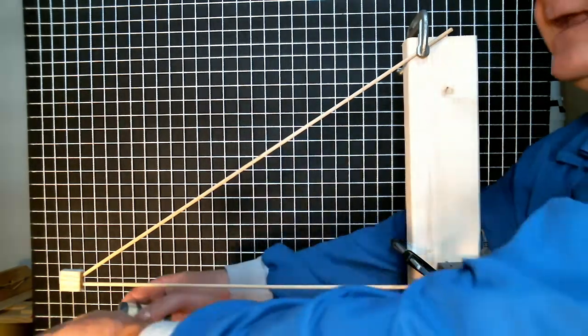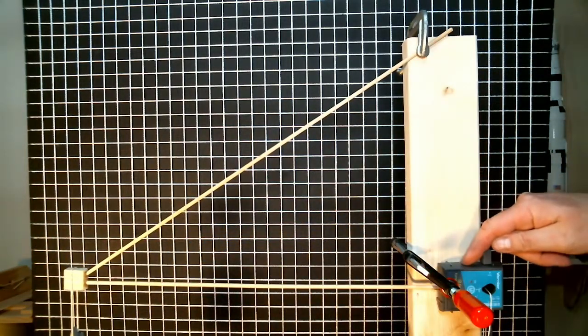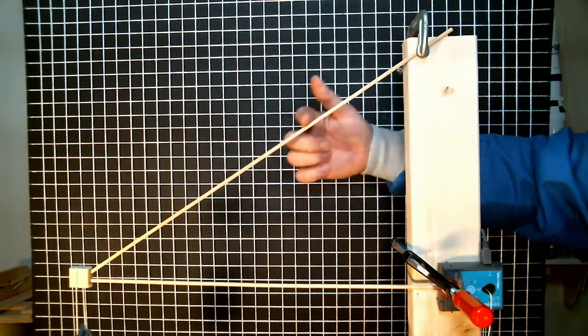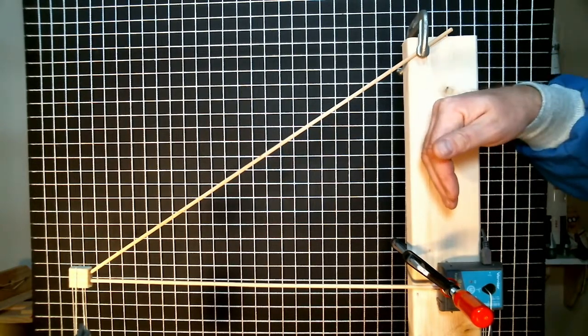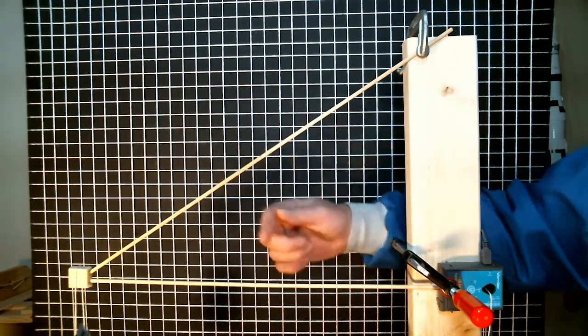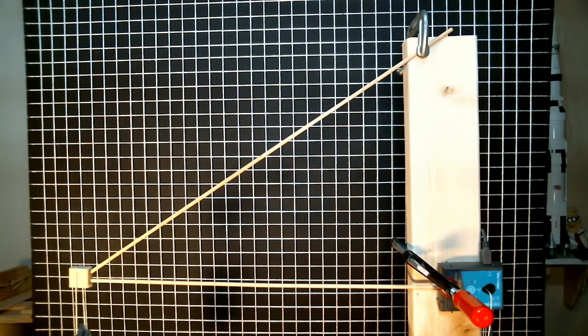When I hang weights on the end of the truss, I can then determine using my force measuring device whether there is a tension or compression force in this horizontal truss member. I'll switch things around and try to make the same sort of measurements on the diagonal truss. I should note that since this truss is supported only at one end, it's known as a cantilever truss — one end is secure and one end is free. When I apply the weight to the end of the truss, it will be either compression or tension in each truss member. I'll take that data and compare it to the theoretical calculations to see how they compare.